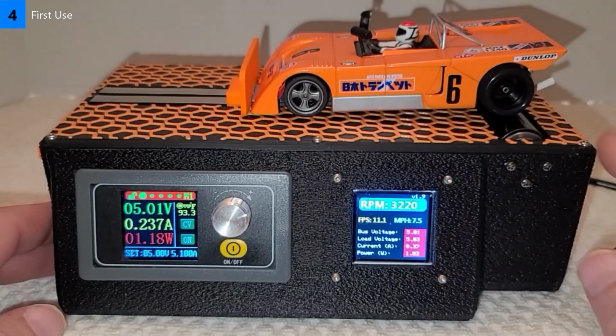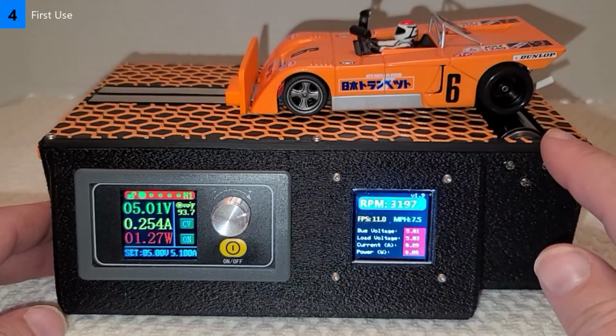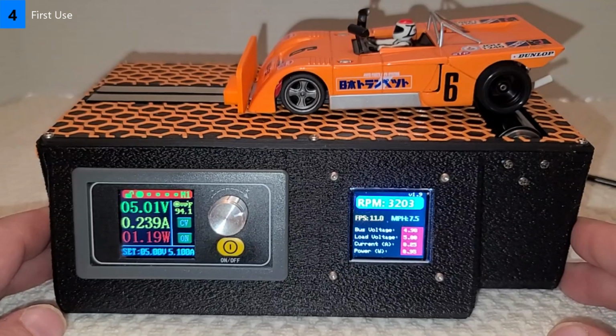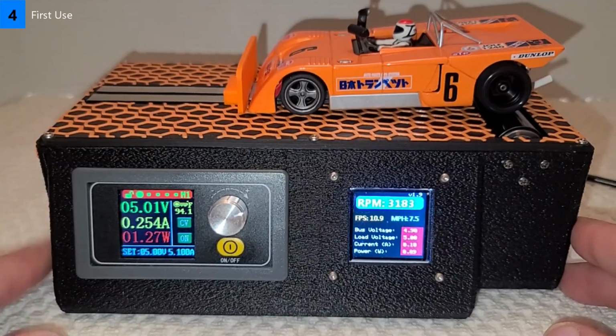These readings are taken at the wheel of your car and are based on the 20mm diameter of the tech bench's roller. For each rotation of the tech bench's roller, your car will travel 62.83 millimeters in distance.